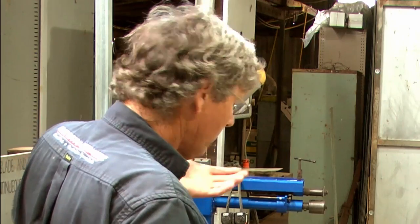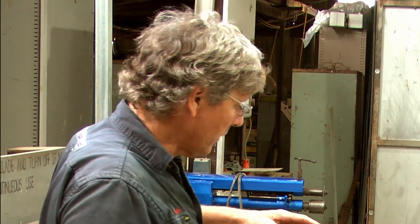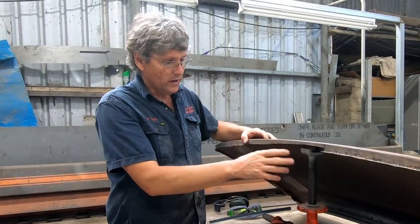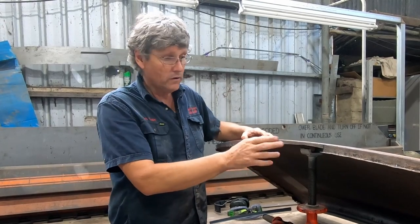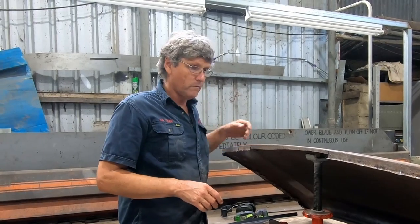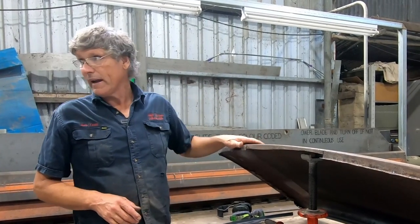So, this sort of repair could have been done on the car. That wouldn't have been any drama with that either. So if you just had a patch like this in the middle, you could take a piece off that inner section and repair it, and then take a piece out of here and repair that and not even have to worry about taking the top off. But like I say, it's not that hard to do.